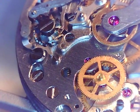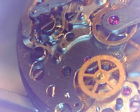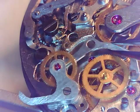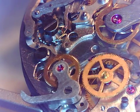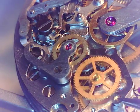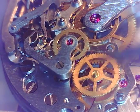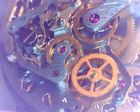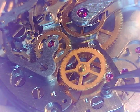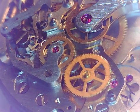alright, come on, focus. Part of the chrono actuator, I don't know. I just know where it goes. This is serviced and jewels are lubricated. We are going to drop that in like that. Work that around. This screw right here is actually an adjuster. If my computer can keep up, right there is an adjuster. It just slips right over the top of that, and then right in here is where our mounting screw is going to go.